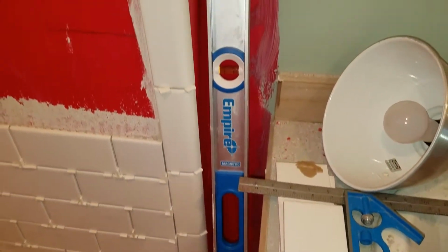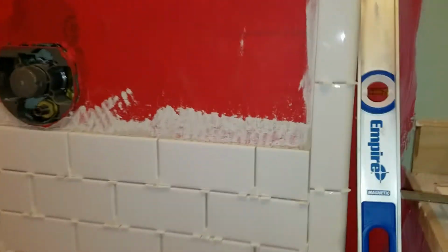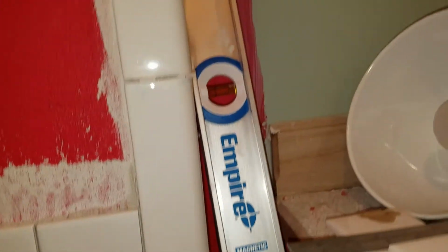And so when you install these kind of tiles, you need to be sure that when you put them in, the corner that you're putting them on is rounded. Because if you put it on a square corner, you see how it's not going to fit. So you need to round off these corners in the Durock enough to be able to put the corners. And then the corners have a different gap interval, about a 1/8 inch difference for each course. So down here you can see the gap here versus the gap on the field tile, and each row the gap gets a little tighter. Somewhere about halfway up it will line up. It probably won't line up exactly, but it will be close anyway.